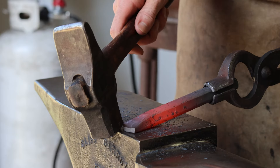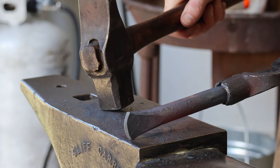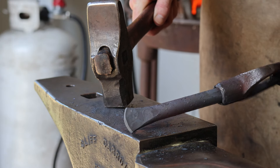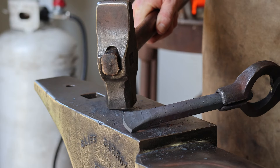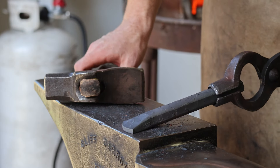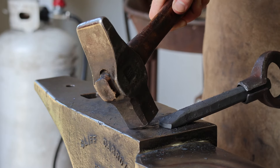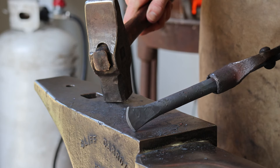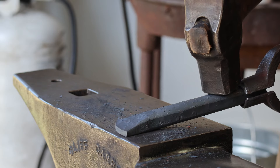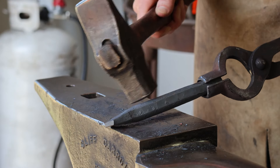An additional thing worth noting is that I am using the far edge of the anvil to forge this taper — the tapering fundamental I talked about in my blacksmithing for beginners part one video. That's how I'm getting this spreading, by simply using a flat-ish faced hammer and hammering down on that steel. I'm making sure that when I'm here at the tip, I'm using half-faced blows so I'm not slamming the edges of my hammer into my anvil face. Now that I've got this kind of where I want it at the tip, I'm just going to start drawing that taper back up toward the struck end of the chisel to bring this to a rectangular cross section all the way up.